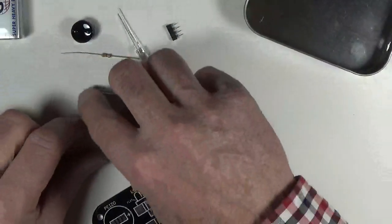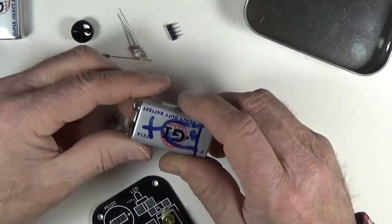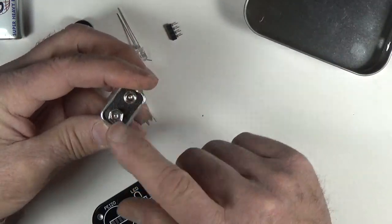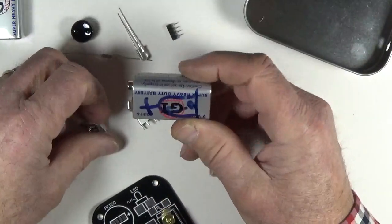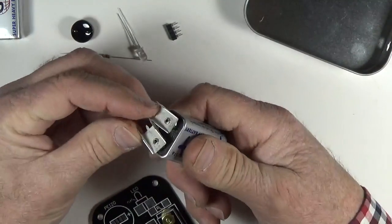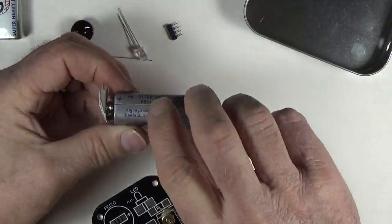The first thing I'm going after is the nine-volt battery snaps. Here's a nine-volt battery I leave around my shop — this one has a tombstone on it that says RIP. I took this dead battery, put a resistor across the terminals, and left it on for a week to make sure there's absolutely no voltage left. Now I can snap the snaps on and know that if they accidentally touch, there's not going to be anything bad happen because there's no voltage.